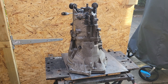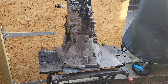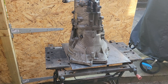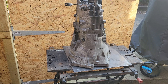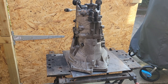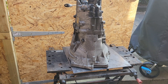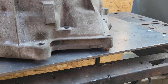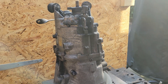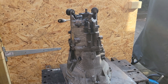Slight change of plan from the last video — I didn't actually cut down this plate to 40x40, there's just no point. What I'll do is drill out the holes for the stud and the mounting bolts for the gearbox, drill a hole through the middle for the shaft to go through, and then just cut out the outside. That'll minimise the waste and give the most useful pieces rather than making extra cuts. So first job is to drill a hole for that stud, mark it out, and then all the other holes will follow against that.